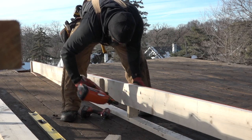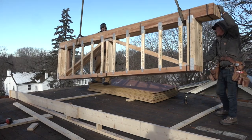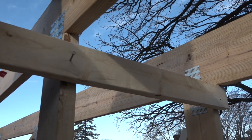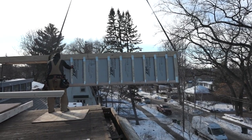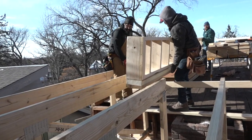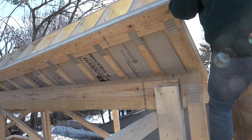With a rough idea of what's about to unfold and trust in the blueprints, he frames the ridge and braces it level. The trusses have arrived, so they stack them on the old roof for the time being. With the trusses on the roof and the crane slipping them into place, the crew drops them in, braces them plumb, and spaces them evenly. Now comes the tricky part — the end truss. The guys added sheathing to the outside of the truss and screwed on the giant barge rafter, which creates an 18-inch overhang. It's heavy, unwieldy, and out of reach of the crane, so they have to set it in place the old-fashioned way — one inch and near heart attack at a time.